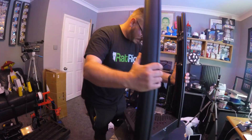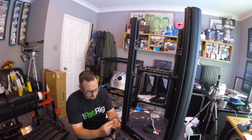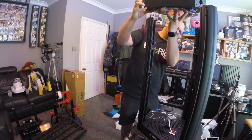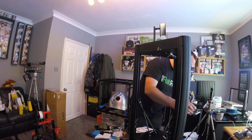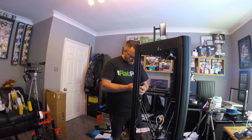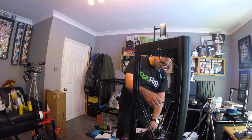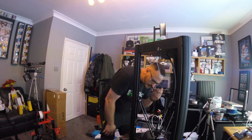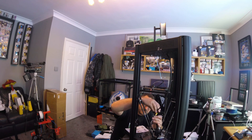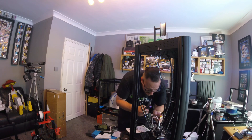Moving down, we have a really interesting touchscreen reminiscent of a modern-day ColecoVision handset. This is a 3.5-inch display and the graphics on boot work very nicely. On the hot end we have a Volcano style, which is a great choice for splashing out filament at high speeds. We have carbon fiber rods which hold the printhead in place — it's a weird material to use, especially as the printhead is pretty heavy with a trio of three fans weighing in around 260 grams. Springs hold the rods in place and give the whole thing decent tension. For Cura fans, there is a print config ready and waiting, and the base config is pretty decent. Tweaking will be key, and more exotic filaments on the speed and retraction side will need adjusting — but for PLA it's awesome. The SR is certainly no slouch; I'm already thinking of installing Klipper to see how quickly I can get this thing to go.